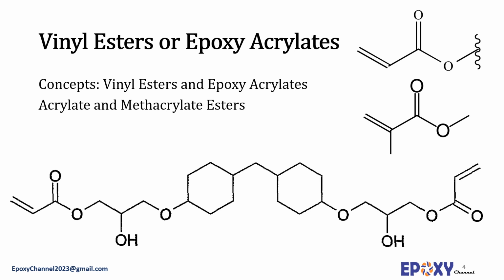Vinyl ester resins can be used in neat form, for example with no diluents, or they can contain either a vinyl type reactive comonomer, for example styrene, vinyl toluene, and trimethylol propane triacrylate, or a non-reactive diluent, for example methyl ethyl ketone or toluene.